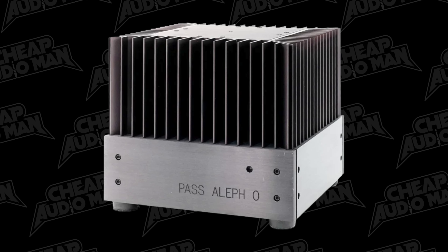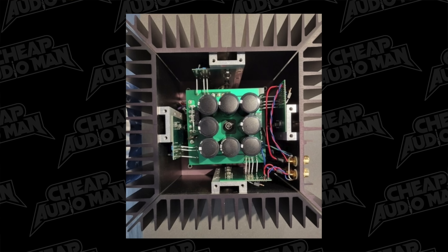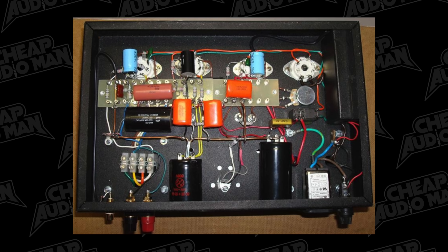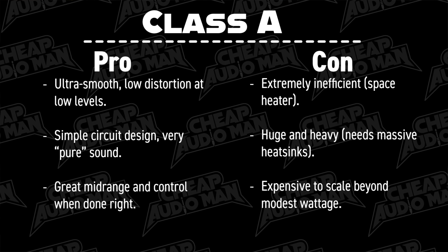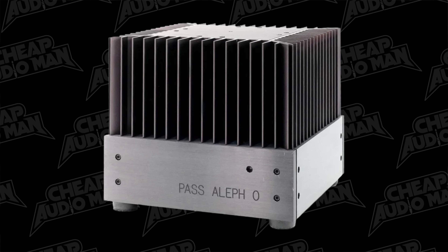Class A amps use transistor technology and they're always on — and they get hot, too. Not quite as hot as some tube amplifiers making 100 watts, but if you want to make 100 watts from a Class A amp, it's going to need to be big, heavy, and hot. It's really inefficient and they don't like to put out a bunch of power. So a 100-watt Class A amp is going to be super expensive. You can get a Class A amplifier around $1,000, but they go all the way up to $5,000 to $10,000. Ultra smooth — some people think they maintain some of that tube magic, yet they can push more bass. But the more affordable ones, you're really probably going to top out around 30 to 50 watts. Unless you want to take out that second mortgage. They sound great, and in my opinion, way better than tube amps. However, if you want your living room not to feel like a Las Vegas bathhouse or sauna, maybe check out the next type of amplifier.